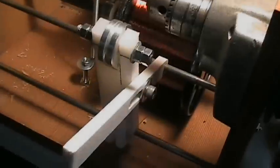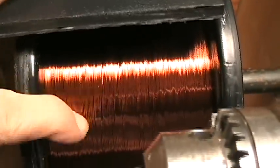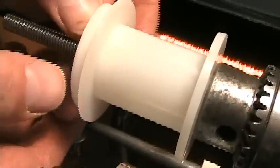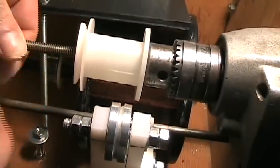I thought I'd make an update of my coil winder here. I've got some very fine wire — 28 gauge on here. And I've made this little pulley attachment here, as you can see. This can be adjusted; there's a pulley here that goes down to a pulley down here, and then the wire comes out onto this pulley and then onto here, where my assistant's going to put on the bobbin, and then I have a little thing to hold the bobbin on and screw a nut to tighten it up.